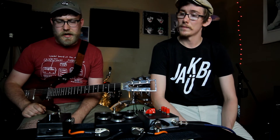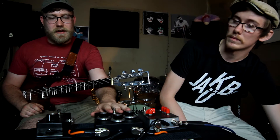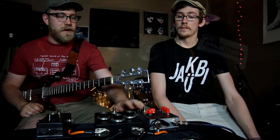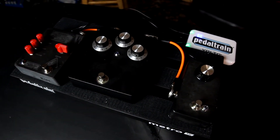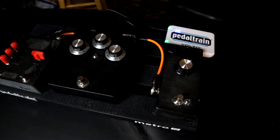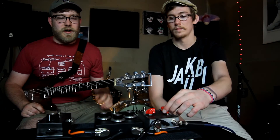Thanks, Corey. So yeah, we have three pedals of mine today. We have the Inverter Drive, which is a one-knob CMOS distortion. We have the Mojo Titan, which is a project board that I sell based on the Damsonic Titan. And then finally we have the Mew Blaster, which is a clean boost design of mine, which uses a 27-volt boost converter and JFETs for a boost with a lot of headroom and dynamics, but also the ability to really slam the front end of your amp.